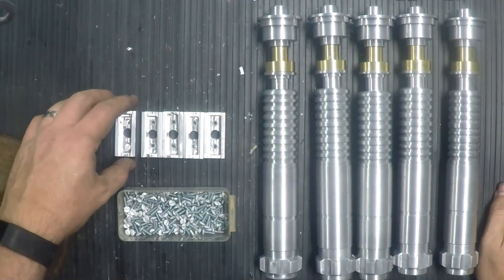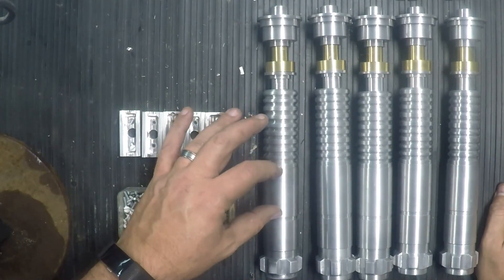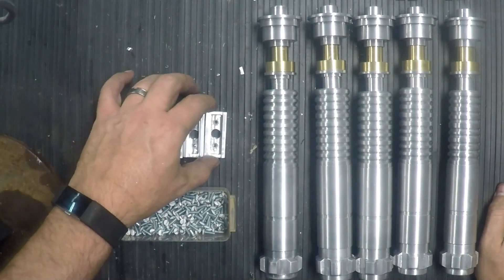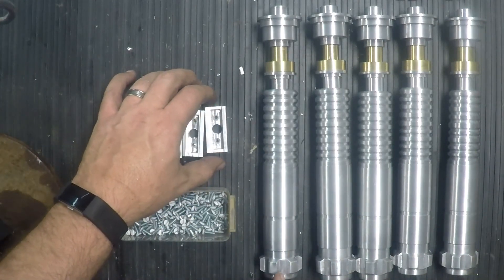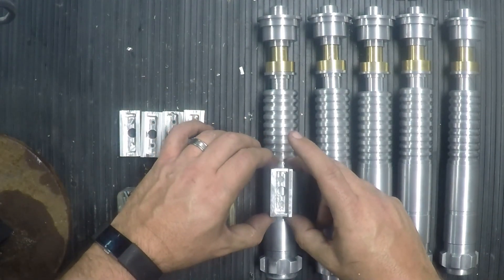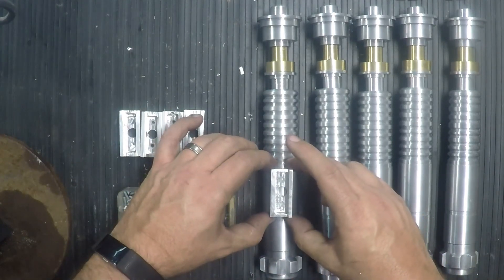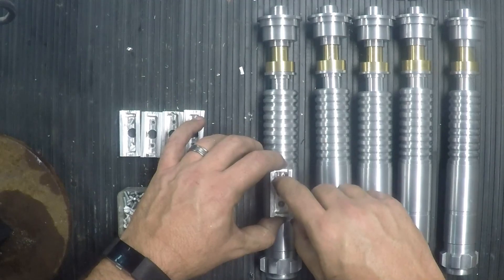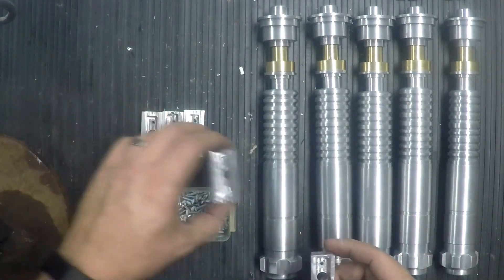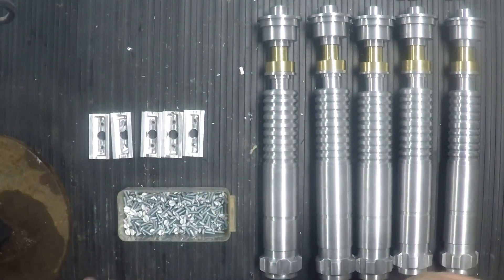That's the end of the boxes. The next step is going to be machining a flat on here that'll line up with one of these. I think it actually should line up with the center line of this area here so that this will screw on. I'll machine out a flat that's just wide enough for this guy to stick in here, then we'll transfer these holes, drill and tap them, and then they'll be able to screw in with these screws. Alright, excellent — see you in the next video.